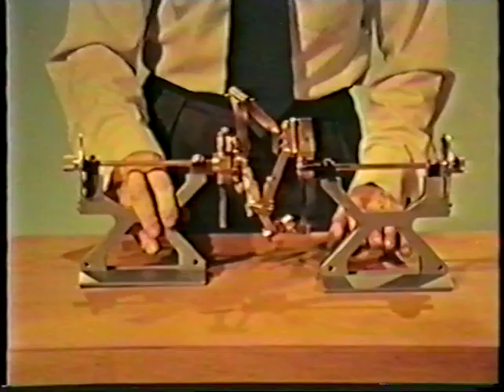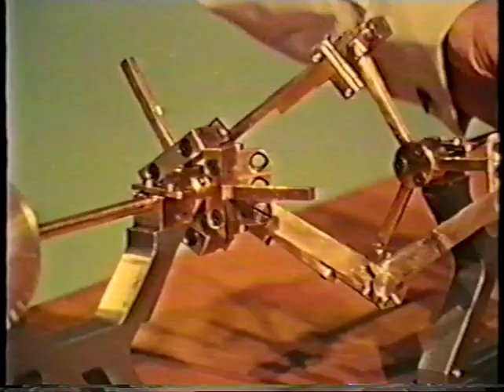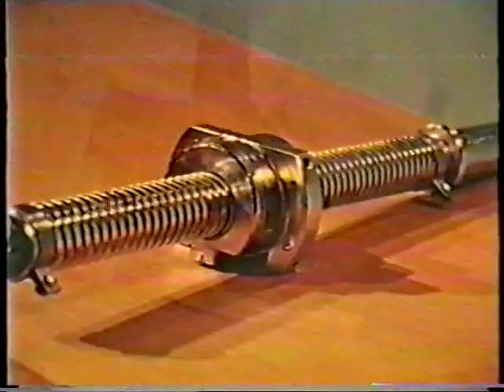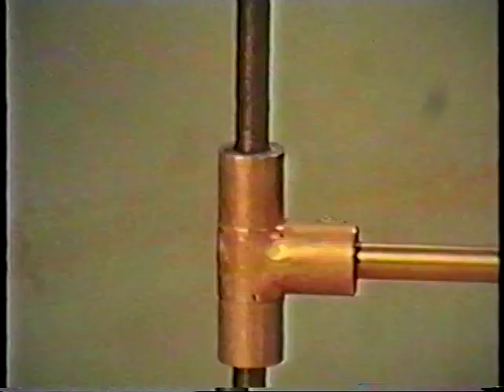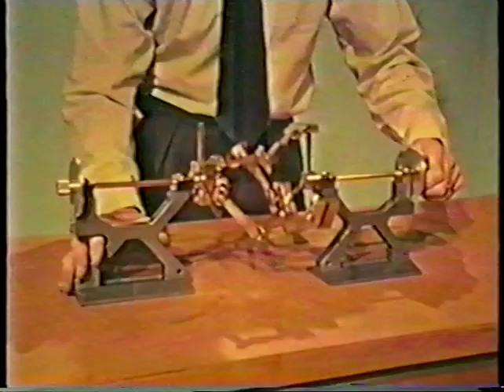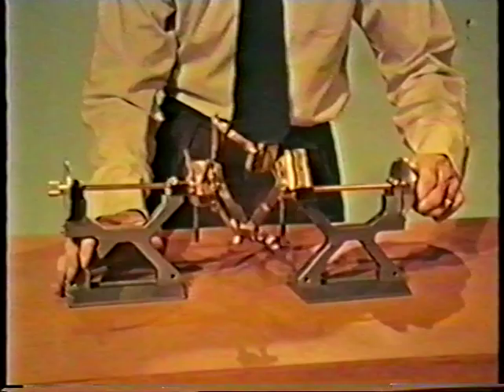They're still plunging. This demonstration model is primitive — it shows up the geometrical principles, but it's not a real engineering design. In parallel shaft couplings, just as for the others, there's a wide range of possible joint replacements, again consistent with the general theory. We can replace hinges with screw-nut joints, or even with cylindrical joints that permit sliding and turning, so long as the required parallelisms remain and so long as there are five degrees of freedom in each connecting chain. The theory of screw systems reveals many variations and, as before, identifies situations that must be avoided to ensure proper functioning.